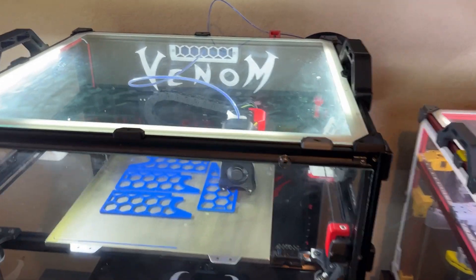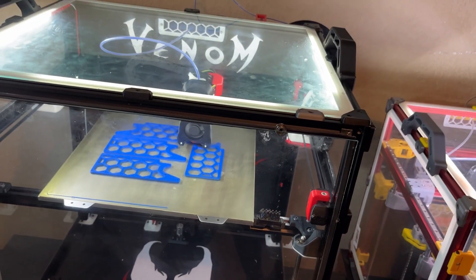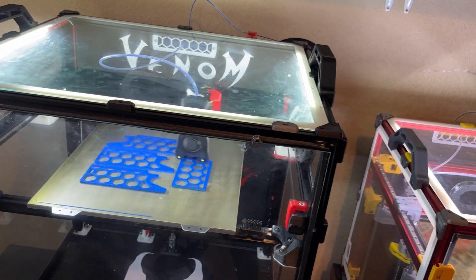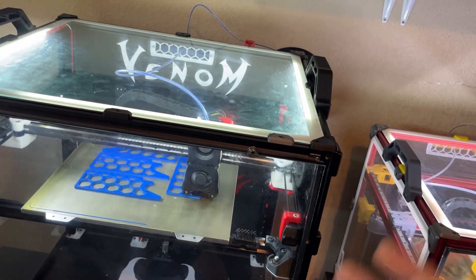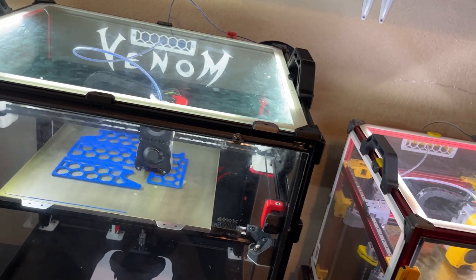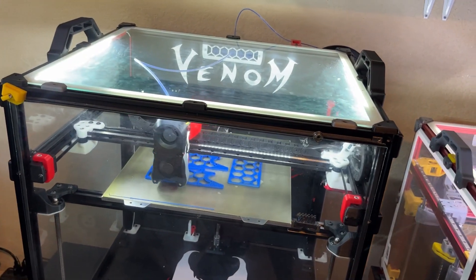Right now I have to leave a gap to allow some heat to come out, because if not it'll jam again. While it's beneficial to make it as hot as possible, it can work against you in this scenario. I'm happy it gets hot — don't get me wrong — but we've got to figure out a different way to cool the hot end without causing jams. Maybe water cooling. Maybe something I'll experiment with in the future if the chamber is going to get this hot.